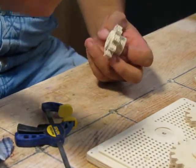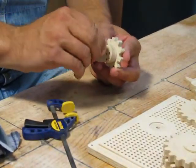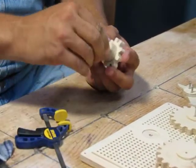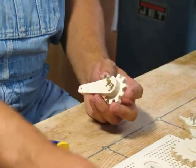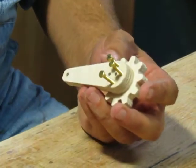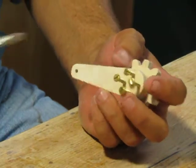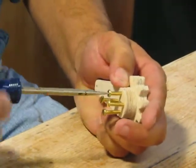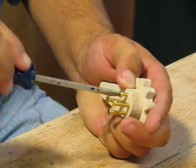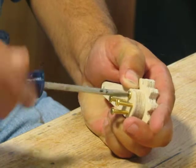There's a three-quarter inch screw there. Typically I wait until after I'm finished with the gear to put those in, but I'll show you how right now. This is something you do after finishing. What we're using is basically pressing threads into the wood with this screw. If you really want a good secure tight fit, you can also put a dab of glue down in those holes before you put these in — that will make a plastic thread inside the wood. So we'll run these in here like so.